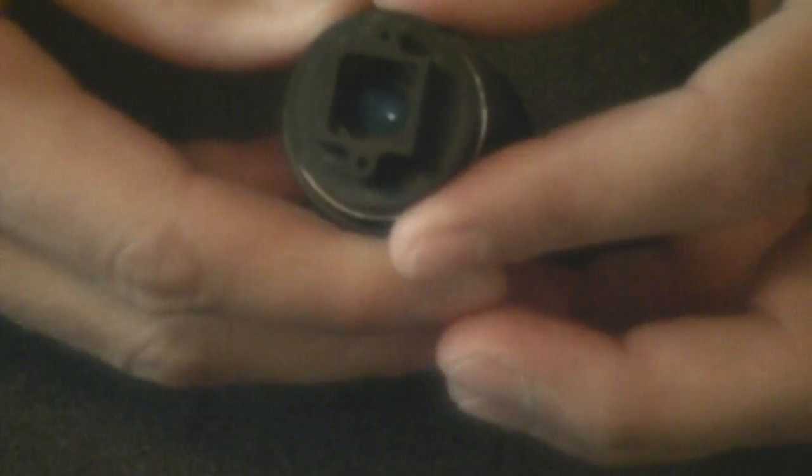Besides the M12 lens standard in the CCTV industry, there are also CS lenses and C lenses. CS lenses are important because you can simply use an adapter ring to put a C lens onto a CS mount. We found some super wide-angle CS lenses that didn't have any distortion, so we decided to create a CS mount for the PlayStation Eye camera. Using the same M12 lens mount we had created before, we adapted a larger CS lens threading onto it. This is the new CS mount — you can see it threads into a CS lens, with a standard M12 mount base, and the filter comes in from the bottom and is held there. It's pretty easy to adapt a CS lens; you just screw it on like a standard lens.